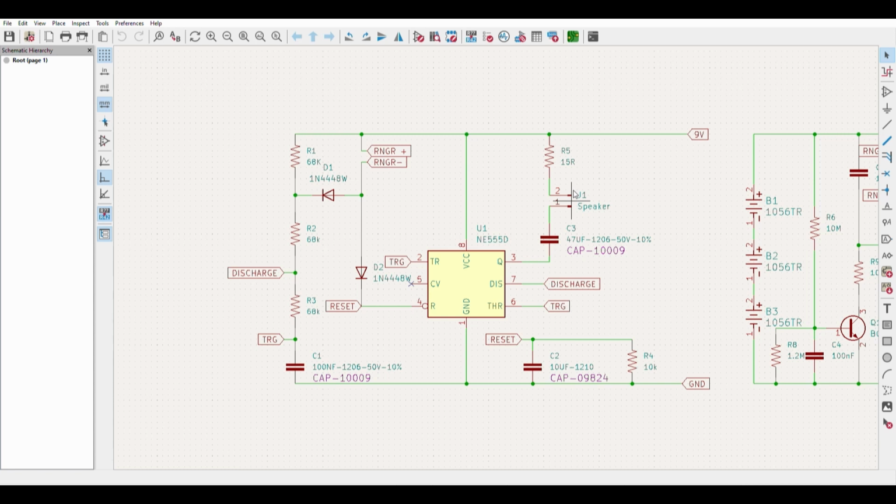Now, that's pretty much it. It's a very simple, very basic circuit. So, if you wish to have different tones coming from the doorbell, you can change a handful of components and get a completely different set of tones. So the components that affect both tones would be R2, R3 and C1. These affect both the first and second tones' sound and length. R1 could also be changed, but it only has an effect on the second tone after you release the doorbell.